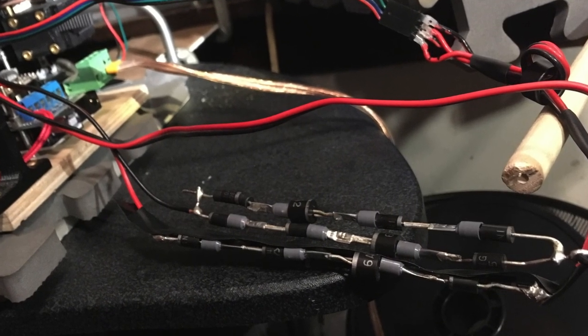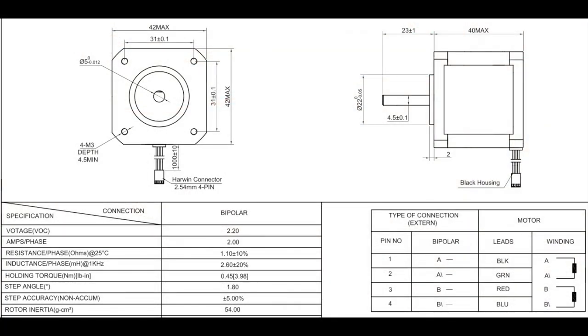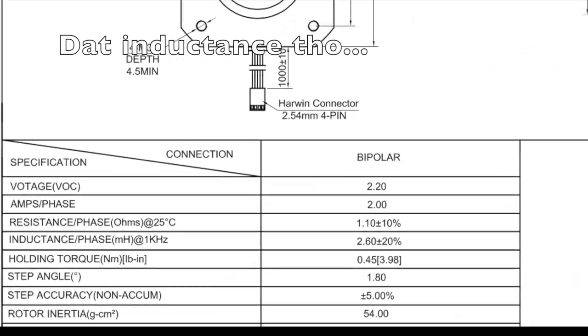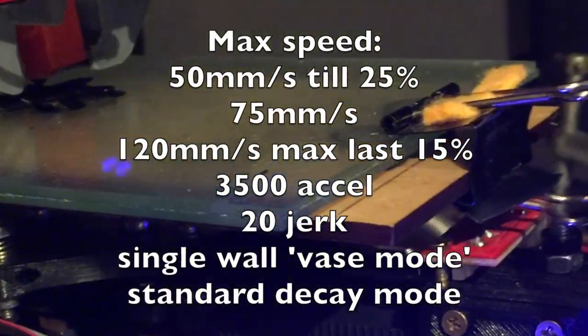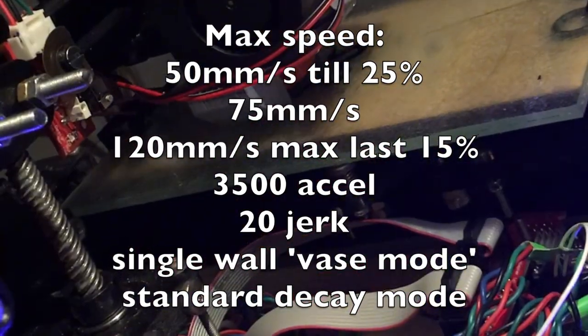What brought me to this point? Usually I use these steppers because I like to print fast. You'll notice a low inductance there and a high current. So naturally I wanted to use the DRV8825 drivers, but then I noticed the patterns. So I switched to higher inductance, lower current steppers thinking that might sort it out a little bit, and I switched to 24 volts. They both help a bit, but not a ton.